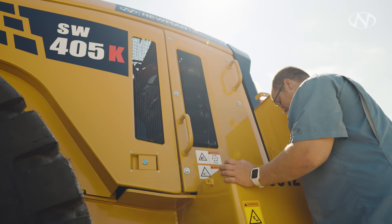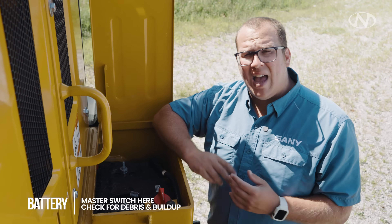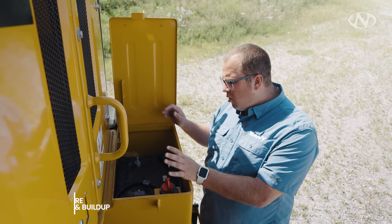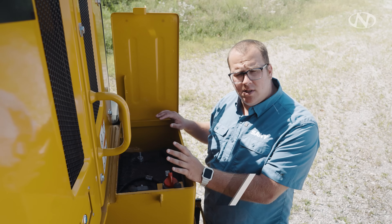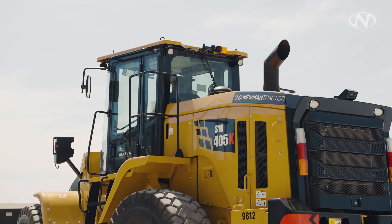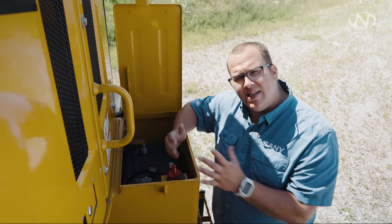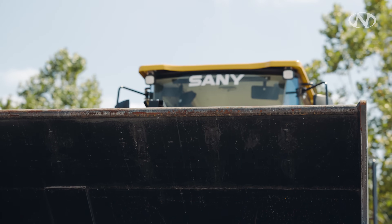When it comes to our battery box and battery disconnect, always wear proper PPE. The disconnect is here and has a place for a lockout tag if you're doing maintenance. Make sure terminals are in good working order with no debris or buildup. This is a 24-volt system — consult your supervisor or OMM if the battery is dead and needs jumping. This machine has DEF — when done for the day or about to do service, wait for the DEF purge to complete before disconnecting the master switch. Shutting it off prematurely leaves DEF in your dosing lines, which can corrode or freeze and bust them. Wait at least two minutes before shutting the master switch off.